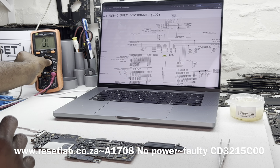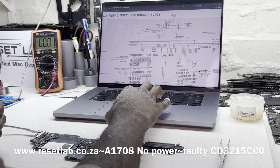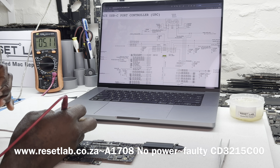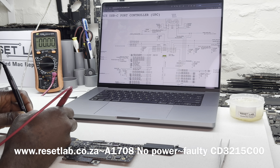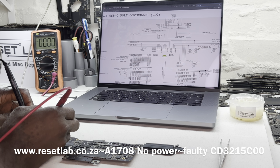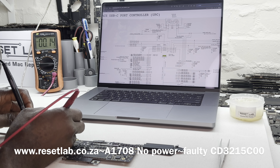Connect our charger, switch our multimeter to voltage mode. Let's measure in one of the fuses here, see what we have. Okay, let's see. So that is 5 volt. And then let's see on the other port. Okay, the other port is 5 volt. Let's see, do we have our PP3V42? 2.93. Okay, just confirm that again. PP bus is 0.2.